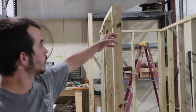We're gonna do a 12-12 roof, which is 12 inches of rise for every 12 inches laterally or horizontally traveled. And that's gonna be an easy roof because it's just gonna be 45 degree miters. Pretty simple, pretty standard. And we're gonna do probably four rafters across the top.